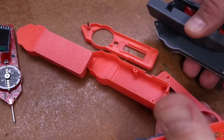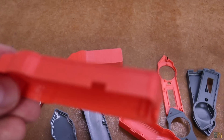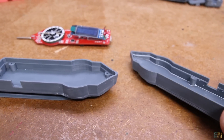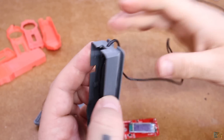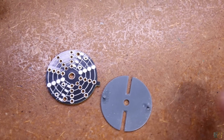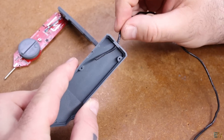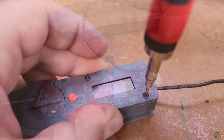I've been designing an enclosure as well — it has a few versions. First I printed it using PLA and my FDM printer, but if you want very small and good quality, the next versions were printed using a resin printer. The last two versions are these ones — one is very small, but the other also has a space for the negative probe, which wraps around and stays inside the socket, which is pretty nice. The dial also has these plastic parts that snap on top of the dial PCB. Then I glue the screen on the top part, pass the negative probe through the hole on the back, solder it to the PCB and close it using some very small screws.